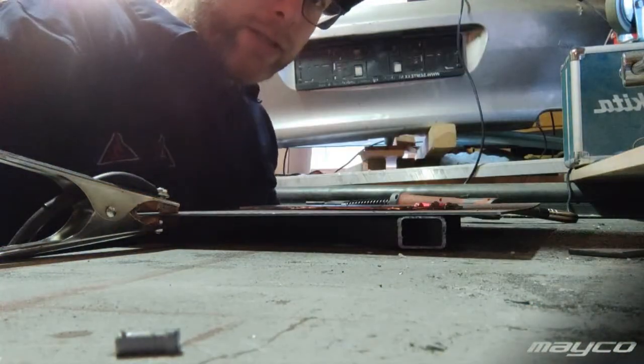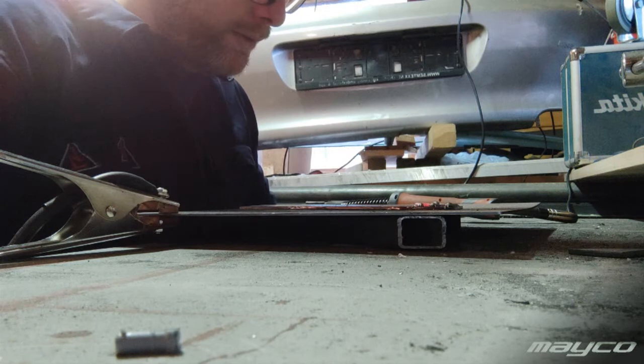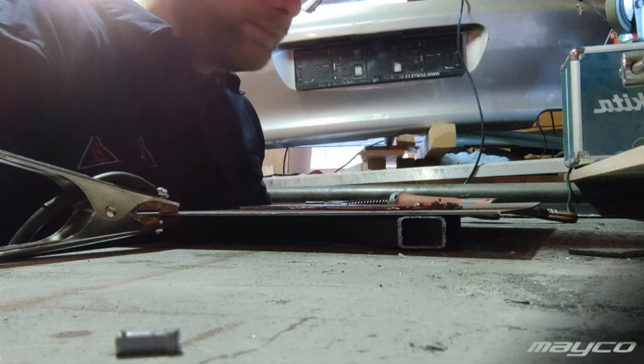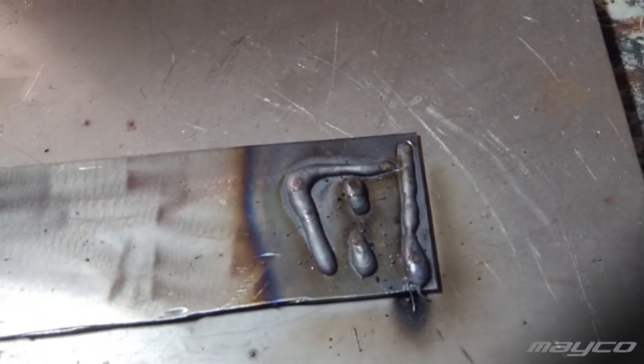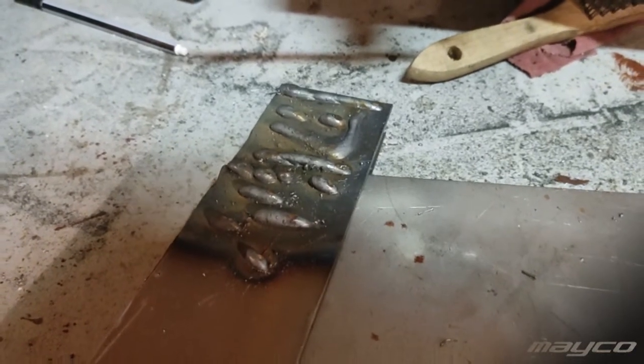Again you could hear it has a lot of difficulty starting up, but once it is welding it welds okay. The weld is now a lot narrower but still quite high — I think it's better though. These are a couple of welds I just did to experiment. What seems to be the problem is that as soon as the material heats up, the settings change.